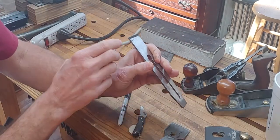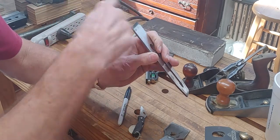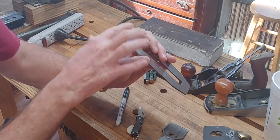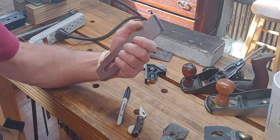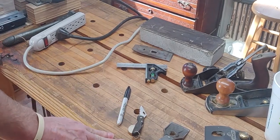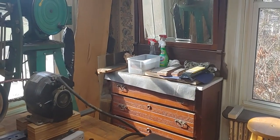There is a point where if you have a super thick iron and a huge concave from the wheel, you'd be thinning out the edge a little. So we'll keep it closer to 30 degrees. I'm going to blunt the edge — you'll see how long it takes to sharpen it back.